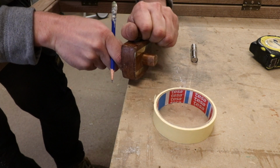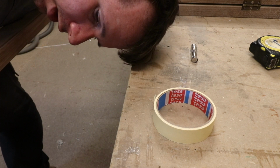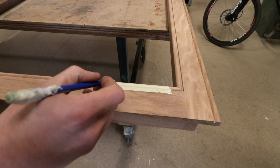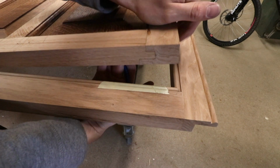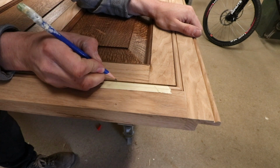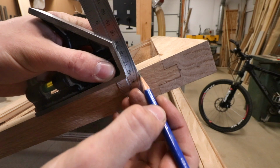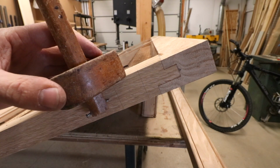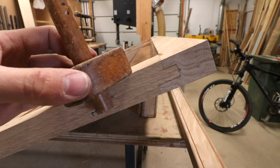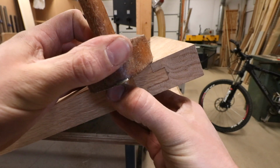So that's the centre line for my drilling on that door. I'll just check it for both of them magnets. They're pretty well the same. Do the same for the bottom, and then we can drill them into the top and bottom of the door. Using the 2 marks of the magnet locations that I've got on the face now, I can just tick them over like so, and square those 2 lines over. We're marking from that same face that we gauged the magnets from. I just stab a centre point hole, like a centre point punch, then drill in on them points.